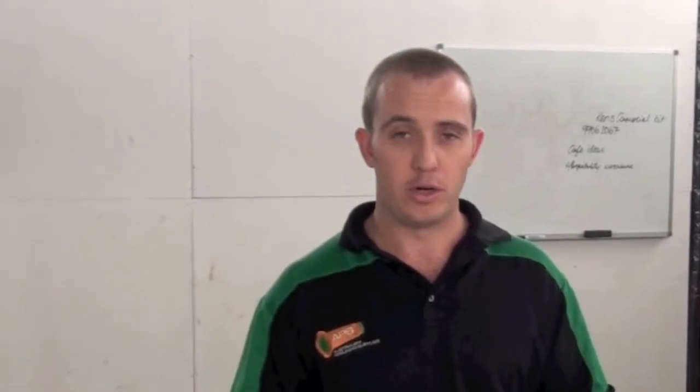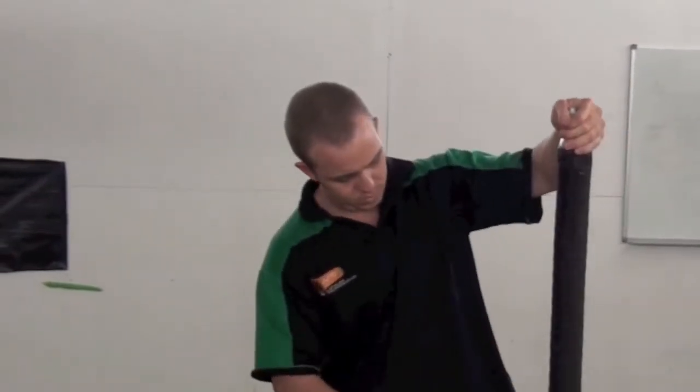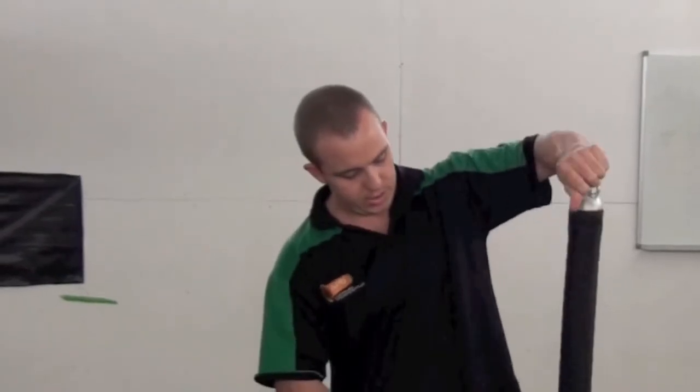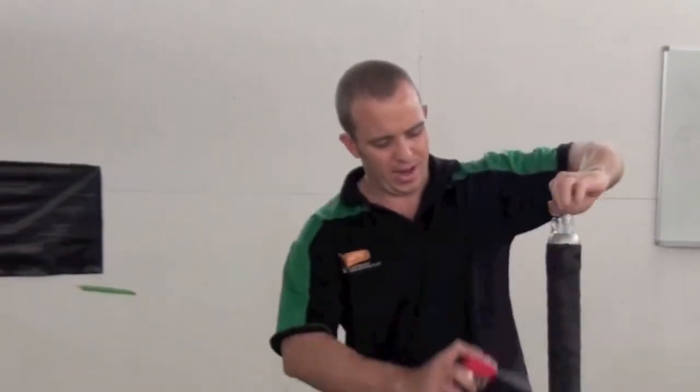You've really got to be careful with your bendy packers because they are a rubber product and they do stretch over time. The number one thing that kills packers more than anything is when it comes in contact with resin. To avoid that, it always helps to give it a good coat of silicone spray. Don't use petroleum-based sprays — our experience is that petroleum-based sprays actually absorb into the rubber, which causes resin contact and shortens the life of your packer. So after every patch, just coat your packer with silicone spray. It'll give the rubber a nice coating and prevent cracking and the rubber drying out.